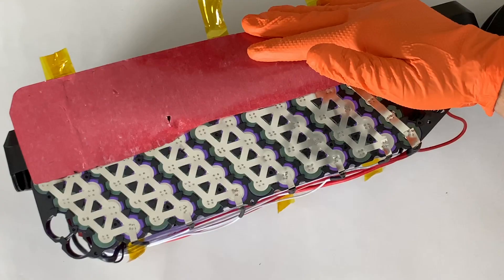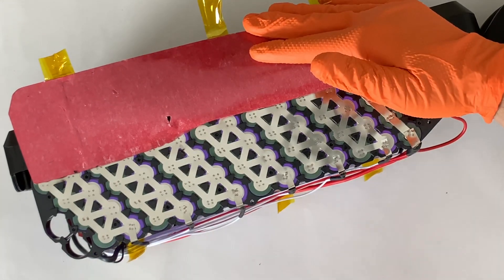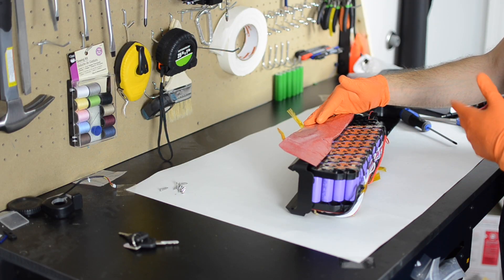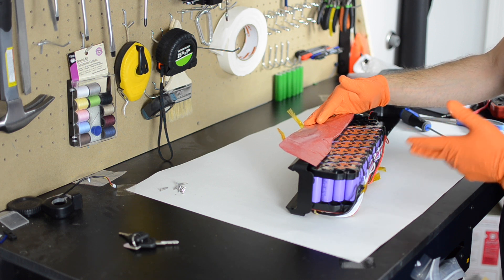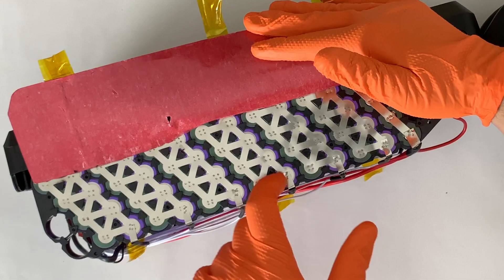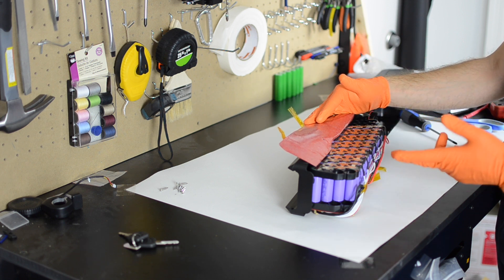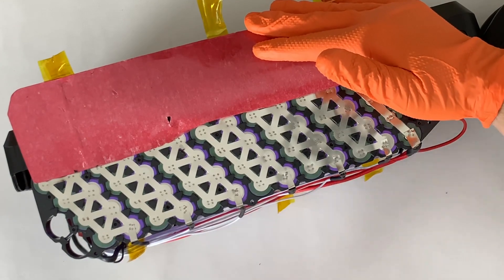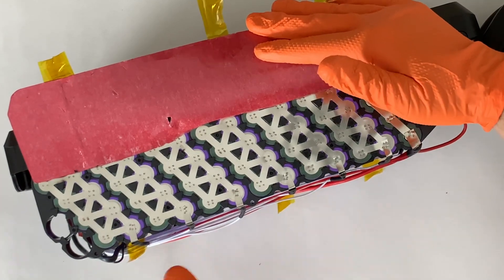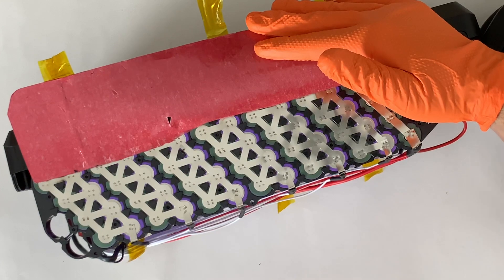The next thing I want to test is whether this is actually 100% nickel or whether this is nickel-plated steel — because nickel-plated steel is cheaper and means the battery can't support as much power, since nickel-plated steel heats up a lot more and is not as conductive as pure nickel. The best way to test this is with a Dremel — use a sanding wheel to grind on the nickel, and if it throws sparks you know you've got steel in there. Do that with a sample piece, not while it's on the battery. The other way, which takes a little longer but works very well, is to take a sample, scratch the surface, and put it in a cup of salt water. If it starts to rust, you know you've got steel in there.